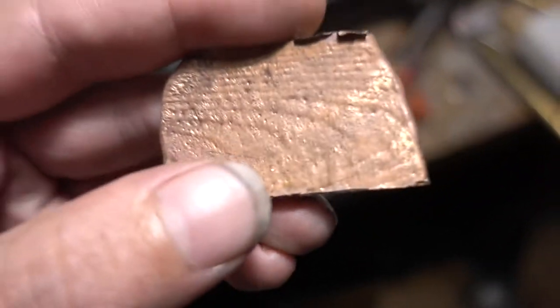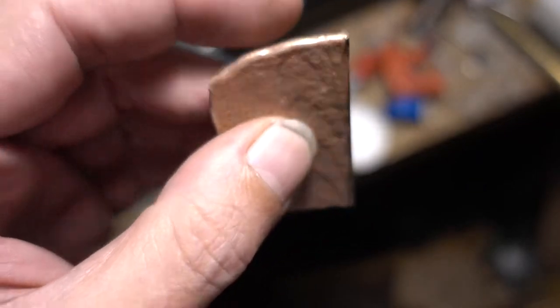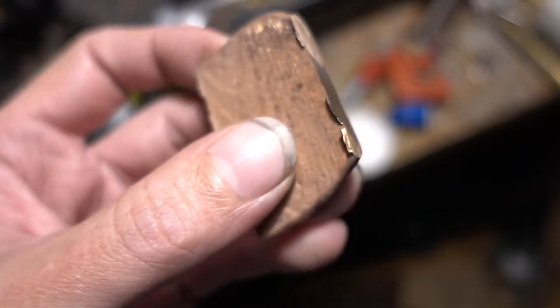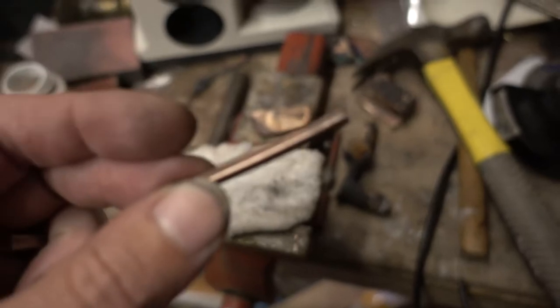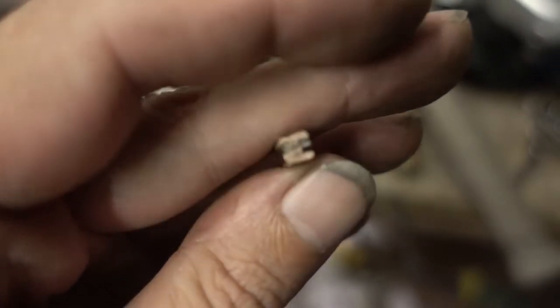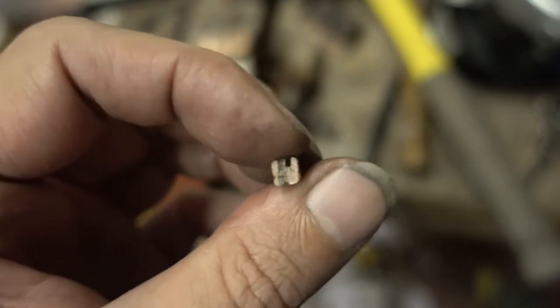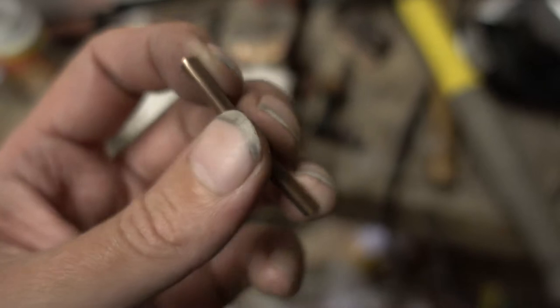And yeah, I was just impatient last time. It wasn't hot enough and it wasn't enough material. Other than that, it should work fine. So I just tried some rolling on this thing, and the material where there are no inclusions, it works fine. Had some problems with some inclusions where it then broke. But that was a casting that was too cold, and it was directly in the front where all the crap accumulates, so where I've cut this piece out. So I will anneal that again and try to get it to a relatively thin wire.